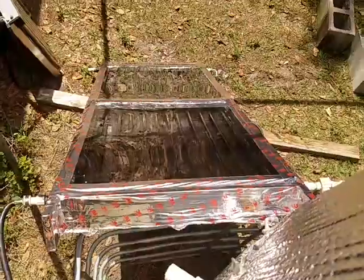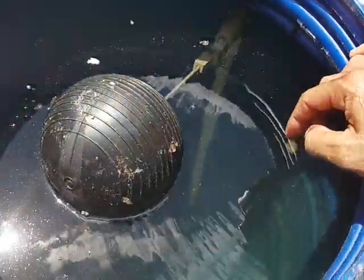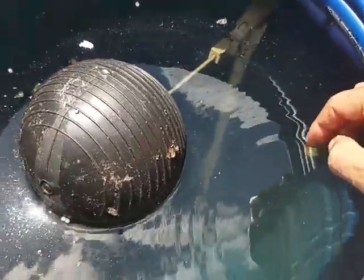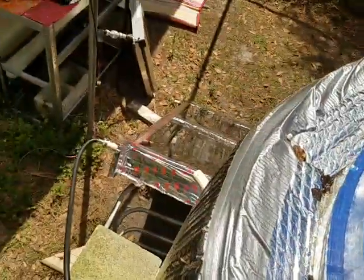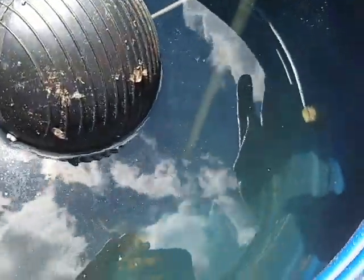You can stick your finger in and — ouch — burn your finger. The top layers of the water are the ones that get warm because the hot water rises and then there's a thermocline. As I get down below, it gets very cold. So you're always heating the top level — here it's warm, then I start to feel it cooler, and now dead cold down there. That's why we're going to need two panels, not one, and more than five good hours of sunlight, because one panel will not fill this entire 55-gallon drum.